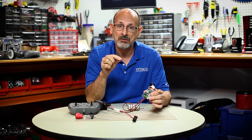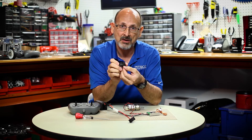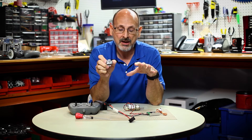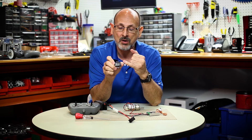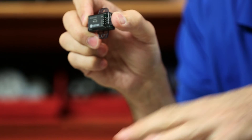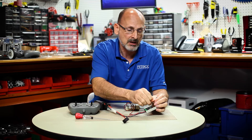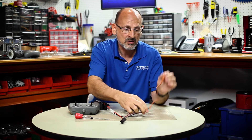The last thing I need to do is connect my wireless receiver. Normally, if we weren't using this setup, we could wire a battery directly into the top slot on the receiver — but we don't need to do that here. We're going to use the power coming from this battery through the motor controller, so I'll take my two leads coming from the motor controller.